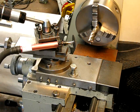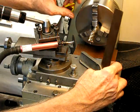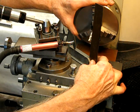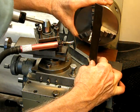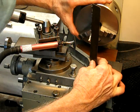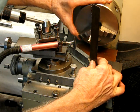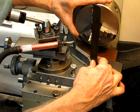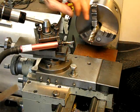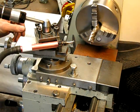It's all quite simple really. The first thing you have to do is make sure you get a square and set up the vertical cutters so that they are on the dead vertical. There are two cutting edges on the vertical on those flutes. This is on a four flute cutter — just modify the action for whatever flutes you've got. On a four flute, you line it up 90 degrees to the bed, which means it's going to be perfectly horizontal this way.